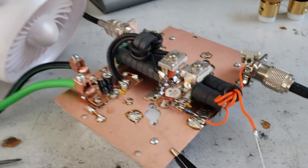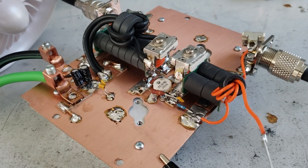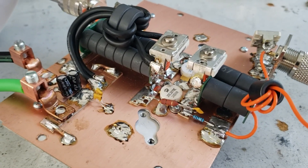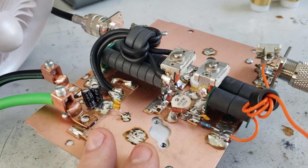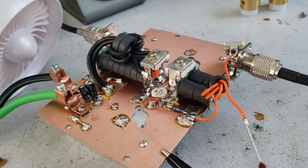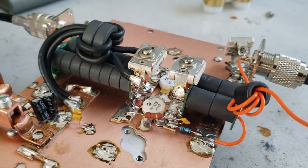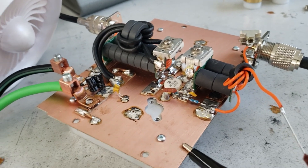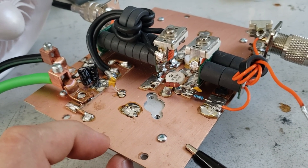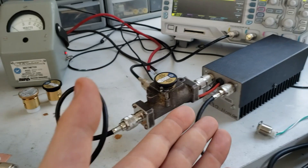So these transistors are quite capable — they make some noise, so to speak. I'm kind of surprised, I think they do a pretty dang good job. They're decent transistors for the price, but they're still transistors — they suffer transistor problems: low efficiency, low gain. I don't know what kind of SWR they can handle, I don't know how much abuse they can handle. I'm not going to find out because I don't really have any interest in building amplifiers with bipolar transistors. This is just a fun project. Maybe one of these days I'll build myself a big amp, build a bunch of two-pill sections and make like an eight-pill or something. I just wanted to show you what I was able to get out of these transistors and how much drive it took.